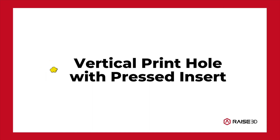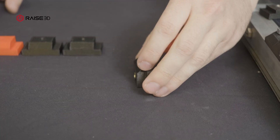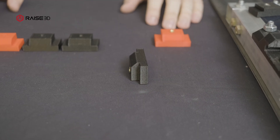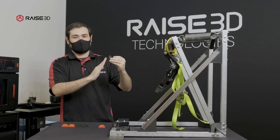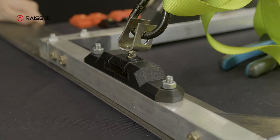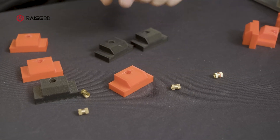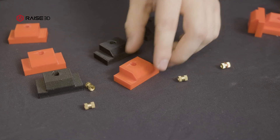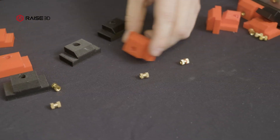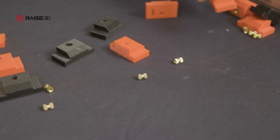The next ones have the same core pieces with inserts pressed in from above, but the parts are printed vertically for a different layer line orientation. The Nylon X ones broke pretty much the same way as the first set — they just slip out. The PLA ones actually acted more like the Nylon X ones in this orientation, tending to slip out of the parts rather than breaking away like the horizontally printed ones did.